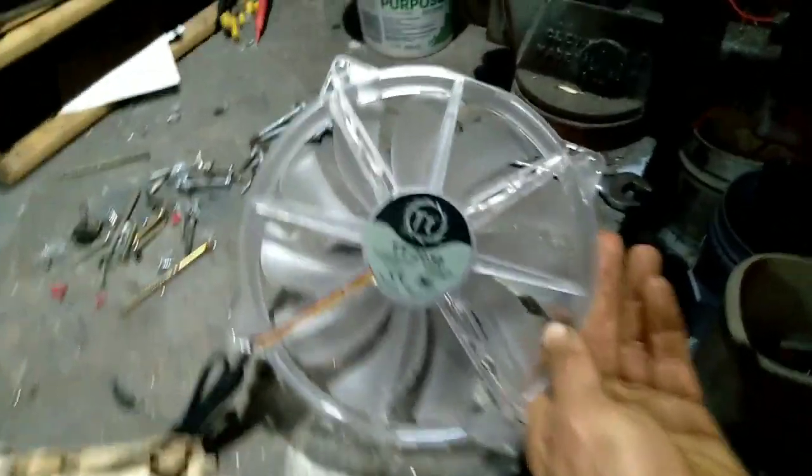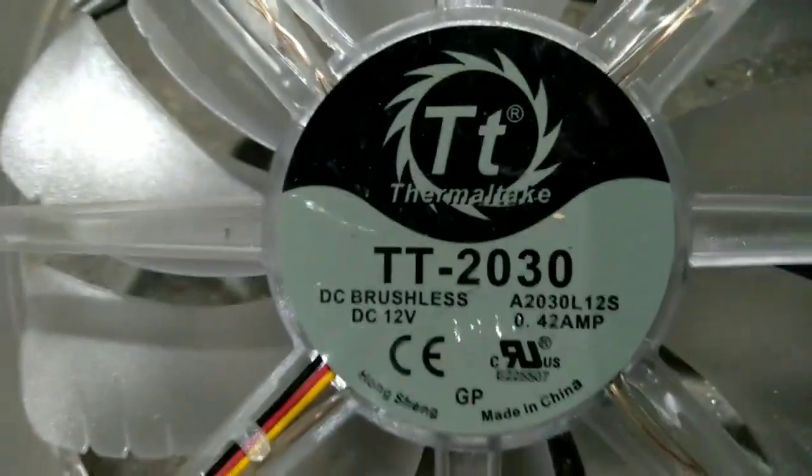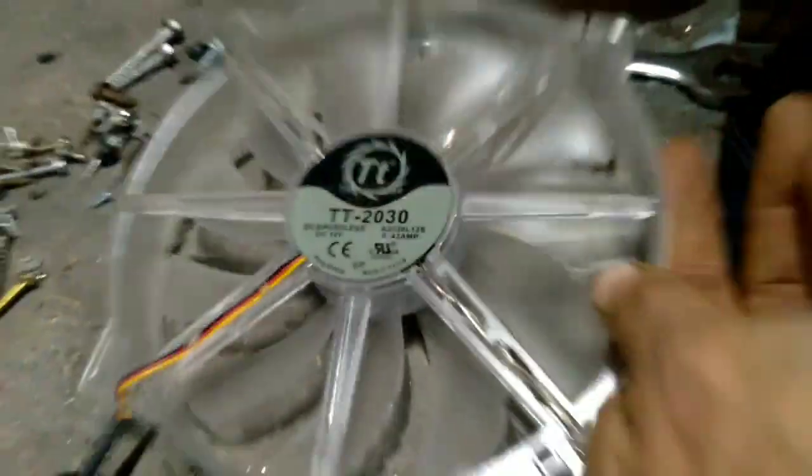And instead of using, again, that huge fan in there to push this hot air into the house, there's individual 12 volt 200 millimeter computer fans that circulate the air into the upstairs. One of these guys. They're awesome. They're silent, and they move a lot of air, and they glow blue. Let's go check them out.